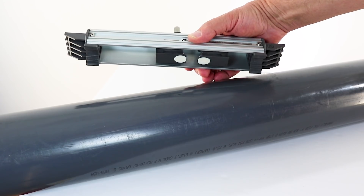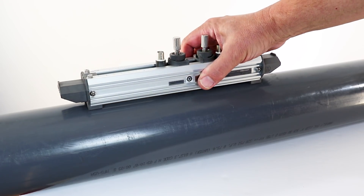Well, perhaps you don't need Dr. Flow's Miracle Coupling, but you will need some type of interface between your clamp-on ultrasonic flow meter transducer and the pipe wall. The typical installation of an ultrasonic flow meter transducer is to clamp it or hand-hold it on the outside of the pipe wall surface. But as you can see, the pipe is round and the transducer face is flat. Sound travels faster through a solid than it does through open air, so we need some type of acoustic coupling to transmit that sound through.